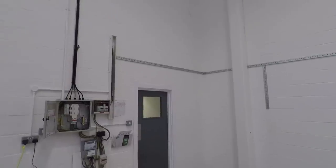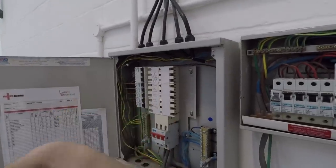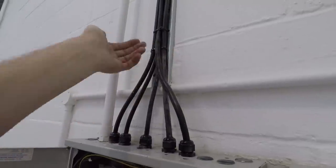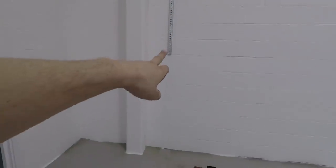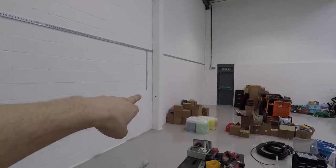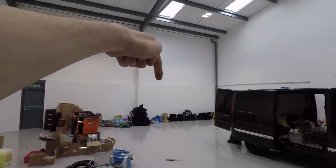We haven't had a lot of chance to get footage this morning so I just wanted to crack on and get a wiggle on. But this is as far as we've got. We basically just followed suit with what was originally here — these are the guts of the boards. We just took the covers off; all they've done is take the tray and turn it upside down so you can get the zip ties in behind. So we've just followed suit. There's the three-phase socket going here, all the way across, another drop there for another socket, all the way across, then we'll just clip it onto the top of this brickwork here.